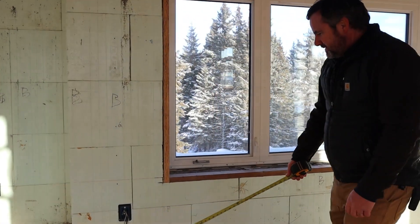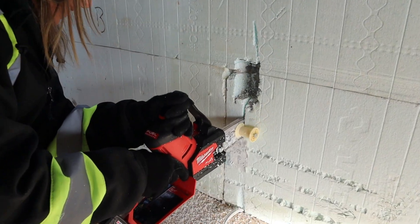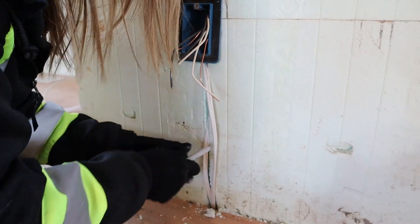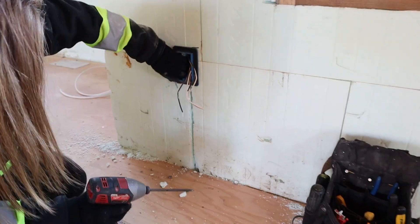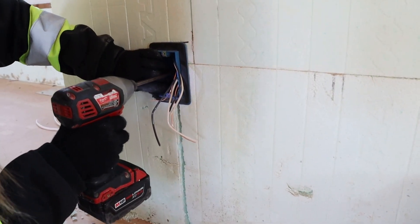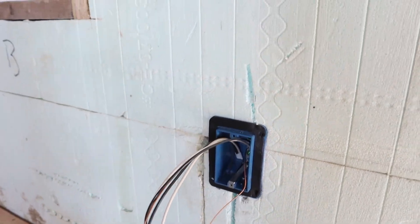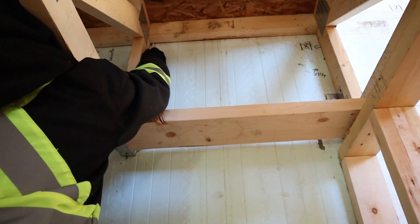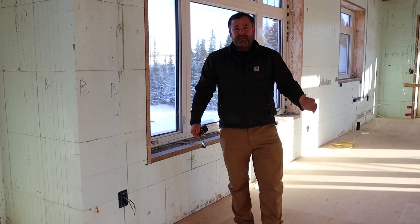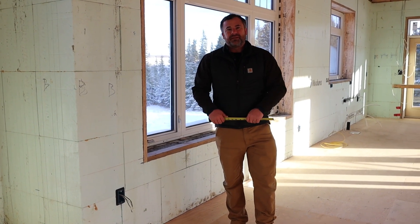This is the electrical you saw downstairs. They just trench it up — using an electric chainsaw or a circular saw — and stuff the wire into the trench. You can spray foam that later. The boxes are just plastic boxes; once everything fits nicely, you take a concrete screw and secure it solid. Depending on how you do your electrical, it's really only the electrical and exteriors that are different. It's not that hard — you don't have to pre-plan anything. All of this was basically determined after it was framed, during a walk-through with the electrician.